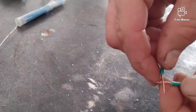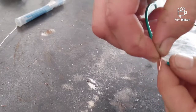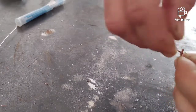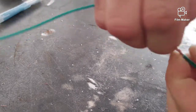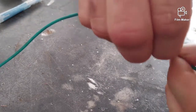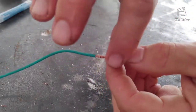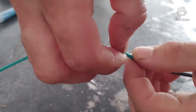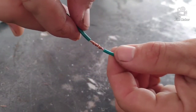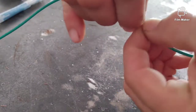I like to just make an X with the wires. This is 16 gauge wire. When you twist it, make sure you don't have any pieces of wire sticking out — sharp parts of the wire sticking out. If you have a little strand like this sticking out, you want to make sure all those are nice and tight and down.